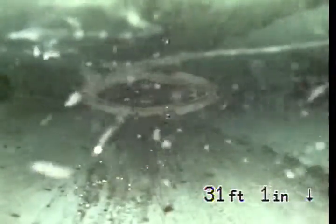So right here is going to be my biggest concern throughout the sewer line. You can tell there's a little bit of standing water inside the line. It goes for about 5 feet or so. Really, the sewer line should be completely drained when the water is turned off inside the house. And that's not the case right here. It's probably only about an inch of water, in my opinion. But again, it's right before this connection to the city main sewer line.